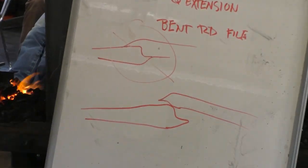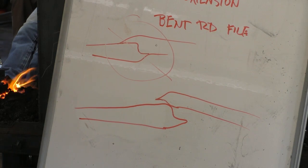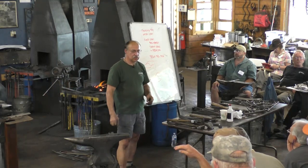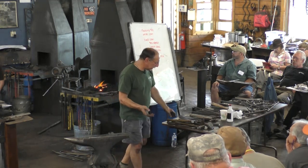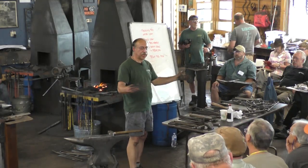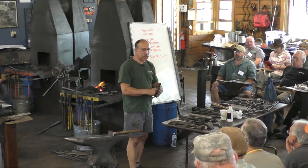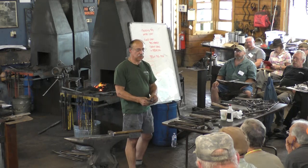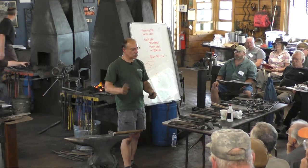And then what's your sequence of hitting that? Well, you try to stick the middle first. Okay. So if you seal the edges down first, then you have the chance of making a nice pocket in the center. So you do middle on one side, middle on the other, and then the ends? Well, I think you'll get a better weld the fewer heats you take. Once you know it's not going to fly apart, you can hit really hard. So if I hit once or twice and I feel that they're solid, I can really mash the middle and I don't have to hit the middle from the other side with a hard blow. And then I look to see if either of the scarves is getting cool and go right to that one.